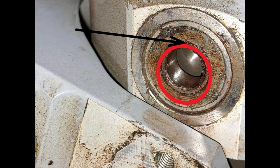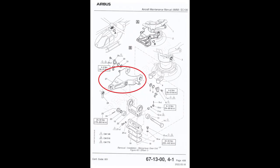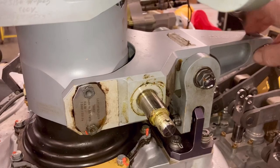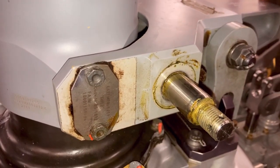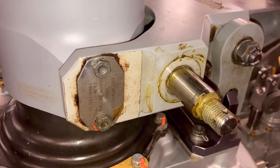That was a quick overview of the shimming procedures on the mixing lever gear unit — the fork lever to the swashplate sliding sleeve. I've seen this done incorrectly a couple of times, so if you're putting this together, get somebody to double-check your stack up before you put it together. Read the entire manual — it's about 10 pages long. Thanks for watching, hope you found some value in the video.